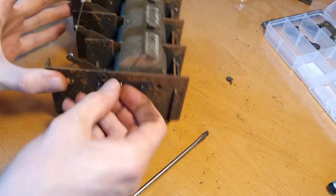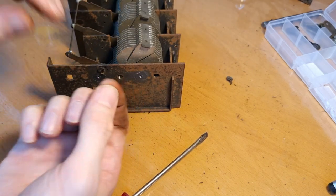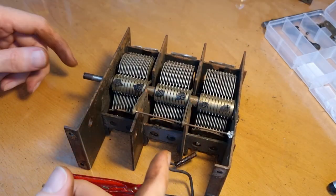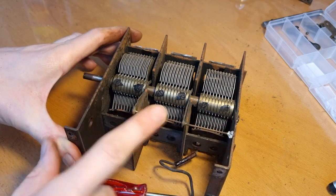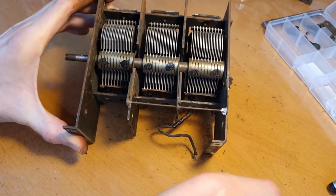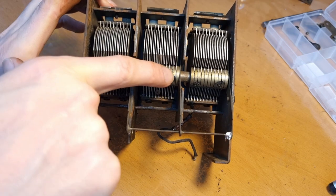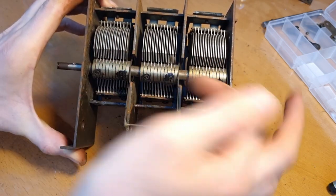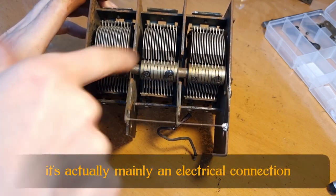Oh, there is a ball bearing in here. Okay, so see how this works. We have this piece over here, which was attached to the chassis via this wire, which I desoldered. That is actually a spring on each gang, which presses the entire shaft to the left, because the gangs are obviously fixed to the shaft via these screws.